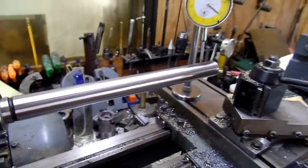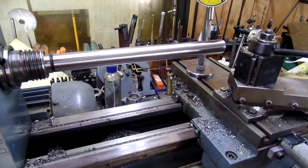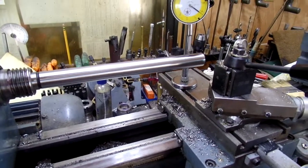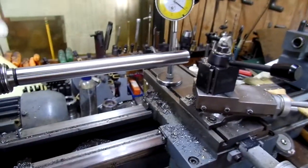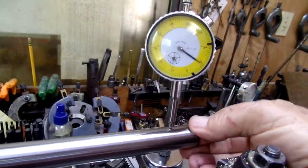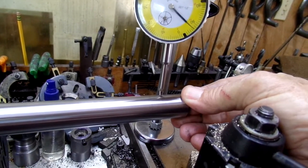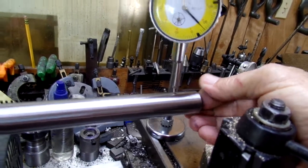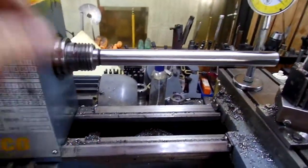The test bar is a worthwhile investment. I wanted to get a number two bar for my tailstock. The other thing somebody talked about was putting this end in the center — not a good idea, it will introduce errors.